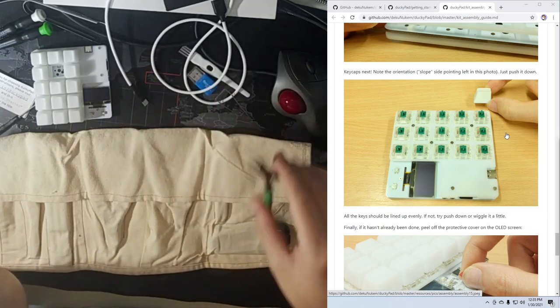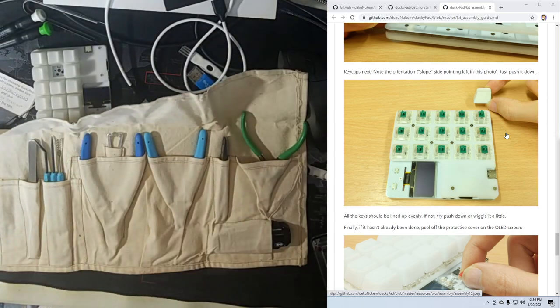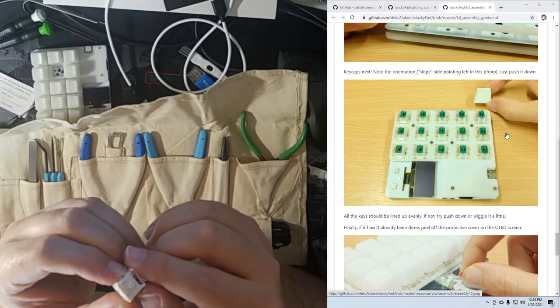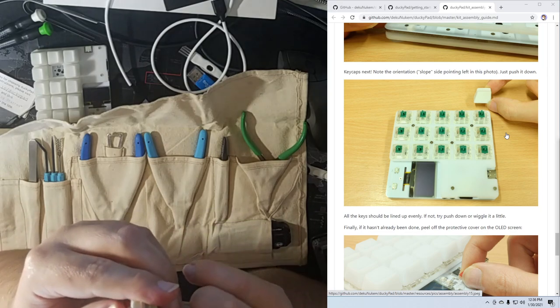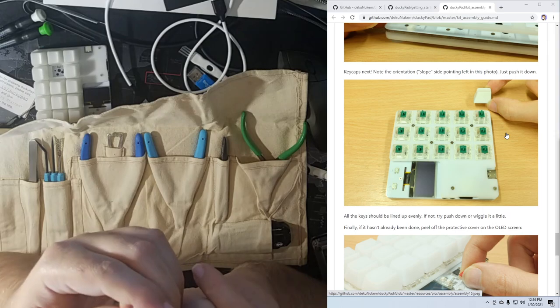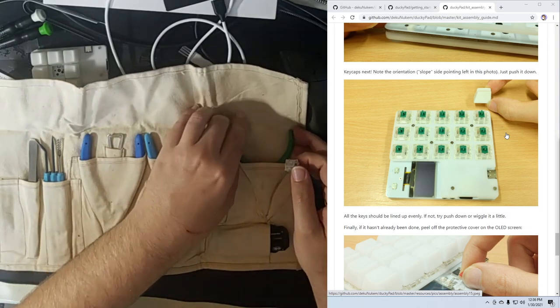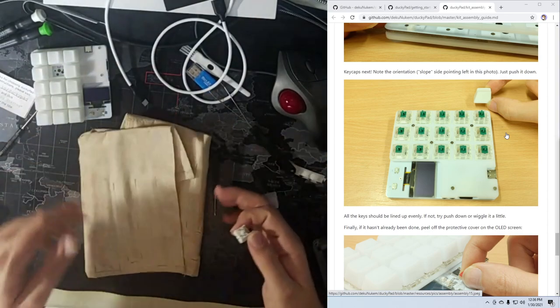I'm going to try putting it back in. So yeah, if you just take a little bit of care, you can usually straighten it out. Although once a bit of metal is bent, the tendency is going to be for it to bend right back there at that same place and to break there. So I got about one more shot at this. Otherwise, I'll use a different switch and I'll just throw this one in the bin marked solder on only.